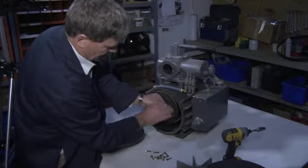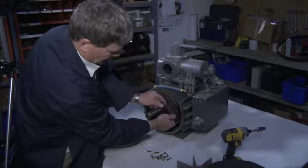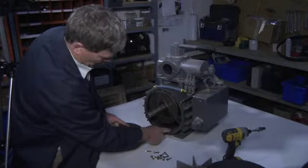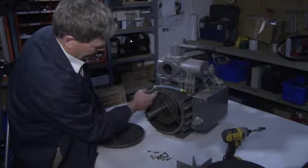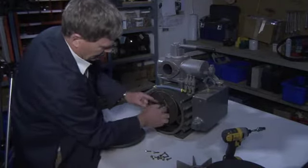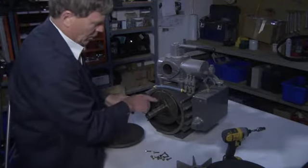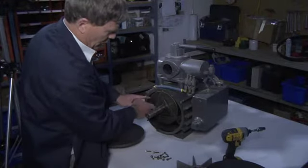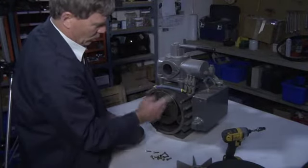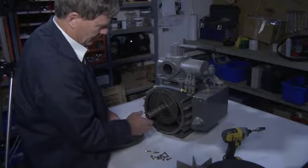As the pump rotates, rotation is this way, centrifugal force forces the vane out. It touches the body, rotates, and by the time it gets back to top dead center, it slides back into the vane carrier port. So it's a continuous movement of the 3 vanes going into the port and coming out of the port and following the wall. That rotation creates all the airflow to activate the pump.